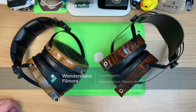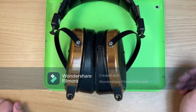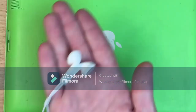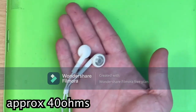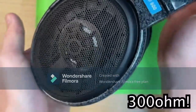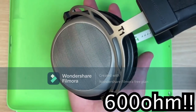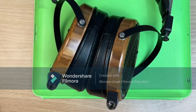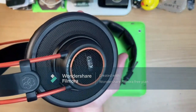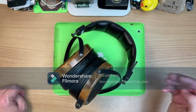Let's get to the really interesting details. Super layman's terms: the more ohms, the more power the headphones need to drive them. There are other factors like sensitivity, and some kind of break the rules a little bit. Apple earbuds are like 40 ohms — anything can run these. The Sennheiser HD 600s are 300 ohms — you definitely want to be using an amp for these. The Beyerdynamic T1s are 600 ohms. LCD 2s are weird — they're only about 70 ohms but they just need heaps of power to sound good. AKG K712s are like 60-something and also need a lot of power. So they kind of break the strategy of more ohms, more power.